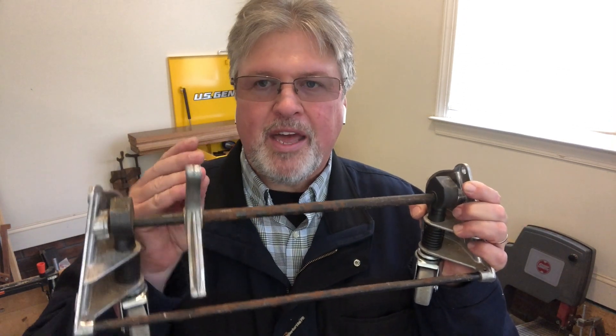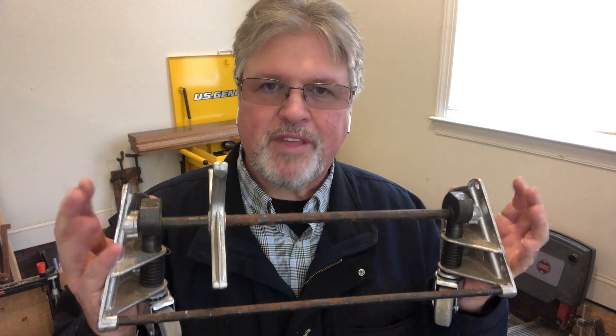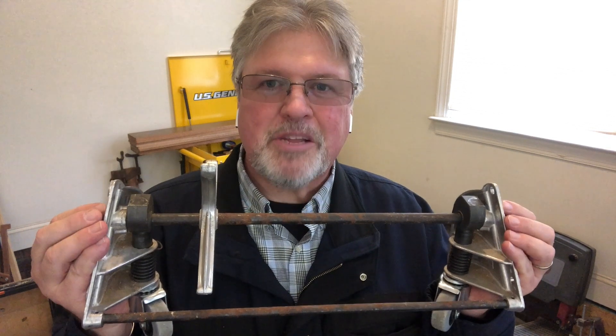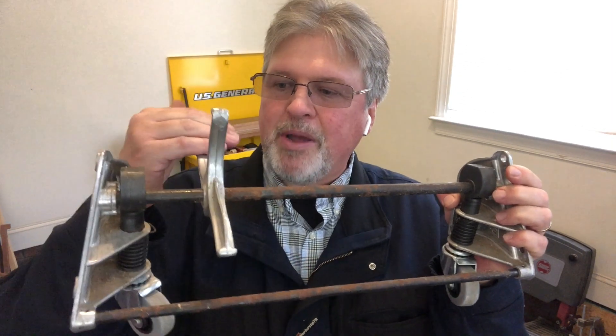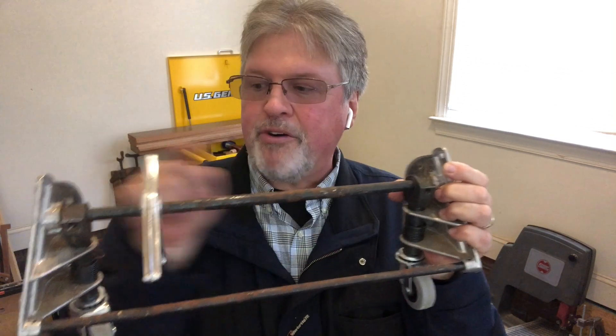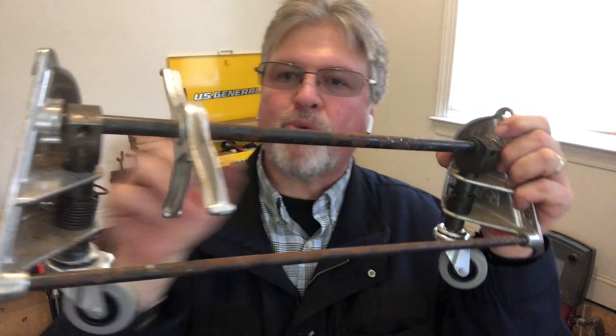But in the 90s, Shopsmith was introducing a number of standalone tools. We'd already had the power station and some stands for accessories. But then along came the router system, which included a pin router, and then they had the crafter station. So they had to make some changes because this caster got in the way of the leg — they ended up moving it a little bit further inboard. And then because the legs on those stands were different, they had to put spacers in between them. They also found out that the legs on the Mark V were giving this some integrity, and because the legs on those stands could flex a little bit, they were having problems when folks were stepping on this — the rotating shaft would pop out of the ends. So they changed them and drilled them out and put a screw threaded into this part here.